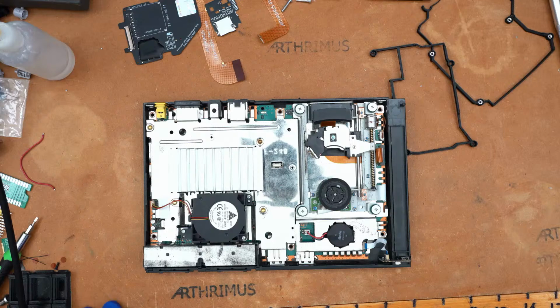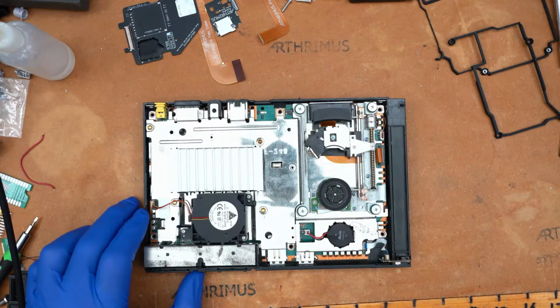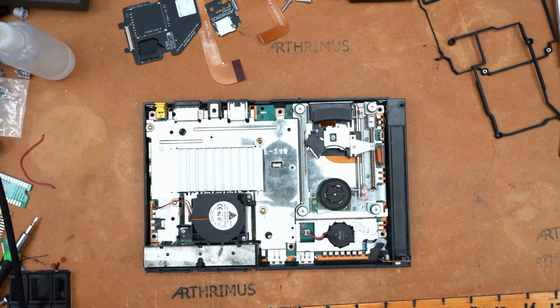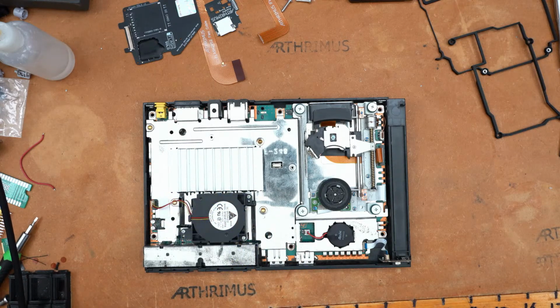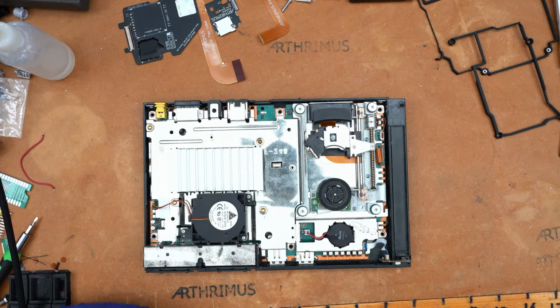Does this act as a fat PS2 HDD? For the most part. The only thing that this is not going to be able to do that a fat PS2 hard drive could do is it doesn't support free HD boot, because the PS2 Slim doesn't have some of the driver components that's required for booting code off of the hard drive. But everything else, like loading games from OPL, accessing the hard drive with U-Launch, that sort of stuff, it all works exactly like a fat PS2.